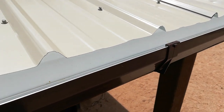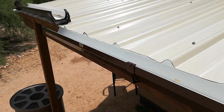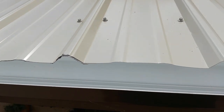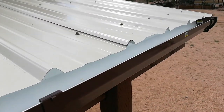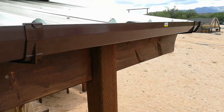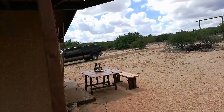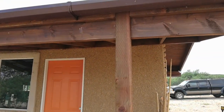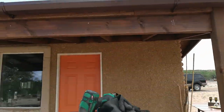I picked up some four-inch PVC gutter material — this is the same gutter material I used on the other side of the solar shed. Being the north side, it won't get a whole lot of sun exposure, so I'm not too concerned about it degrading. I had five feet leftover from the previous installation, so I bought a ten-footer. As a result, the gutter is not going to go the entire span of the overhang — there's going to be about eight inches on either side without gutter.